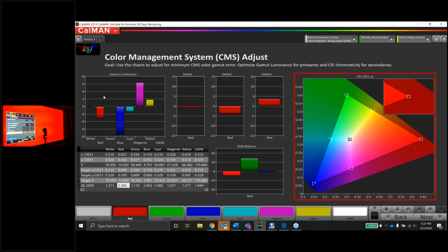And you'll notice the delta L graph. This graph measures the luminance error. So as we get to our correct value over here, the delta also zeroes out. The delta tells you how wrong it is. So if it's correct, then there's no delta error. If it's way off, then there's a big delta error, right? So this is at 0, this is at 0, red luminance is fixed. That was super easy. Now maybe, just maybe, we can get the dot in the hole.